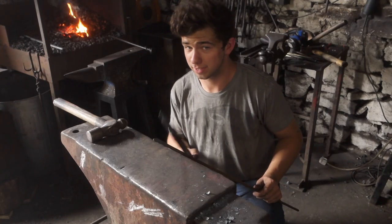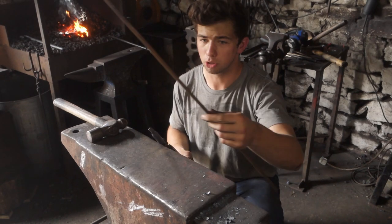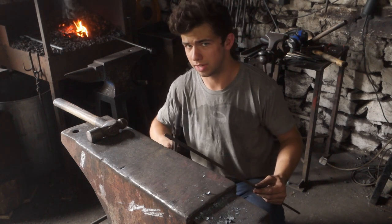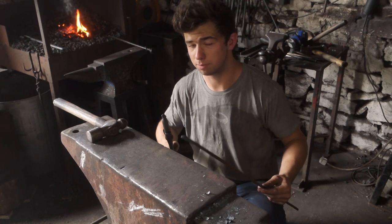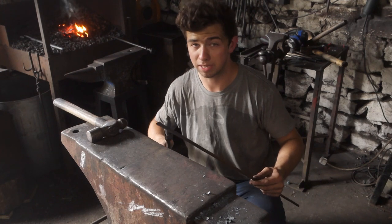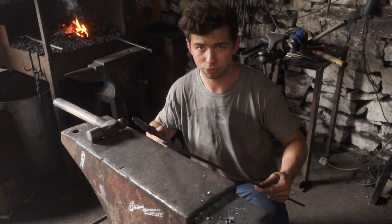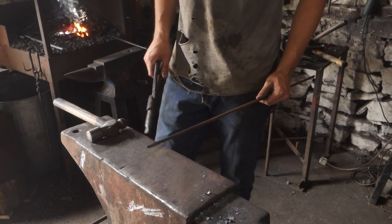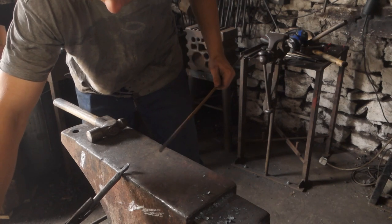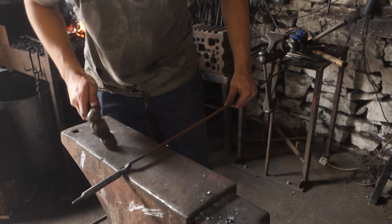There's going to be a lot of forge welding today. This is the first weld — it's just a simple scarf weld. You'll notice that I didn't upset the stem bar as I'm going to forge a taper on this bar anyway, so there's no need to upset the end really because it's going to get forged down thinner than 8mm. You only really upset a weld if you want the final dimension to be what the bar is already. So if I wanted the stem to be 8mm round bar, I should have upset the end before forging the scarf. So I'll get these two pieces hot in the fire to a forge welding temperature, bring them out, rest this one on the far edge so the actual scarf is up off the anvil so it doesn't cool down too fast, then get the handle bar length, set it down like that, hold it there, drop your tongs, get it set.